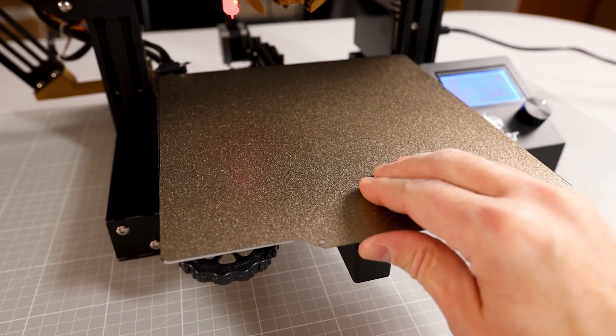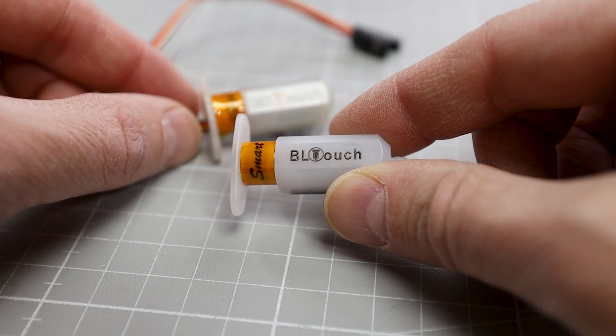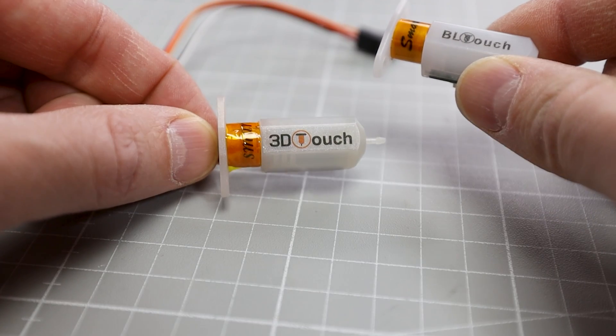That's why using a probe is the better solution in my opinion, resulting in a much faster and more automated process. It's also going to be more consistent with different surface types. If you're going for a removable magnetic build plate, it makes even more sense as it won't be in the exact same position every time you take it off and put it back on. The BLTouch uses a deployable pin to measure a point of contact in the bed leveling process. The original BLTouch costs around $35 to $40, or a clone version like the 3D Touch costs around $20. All of them will give reasonable quality results, and both options with accessories are linked in the description.